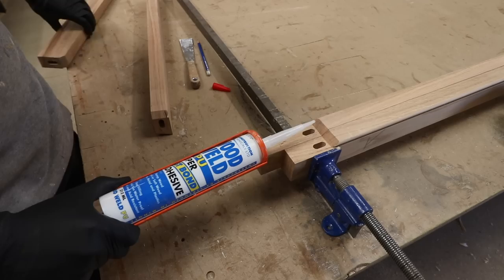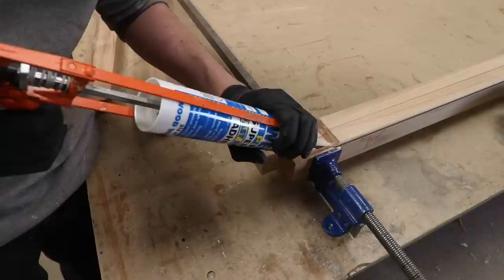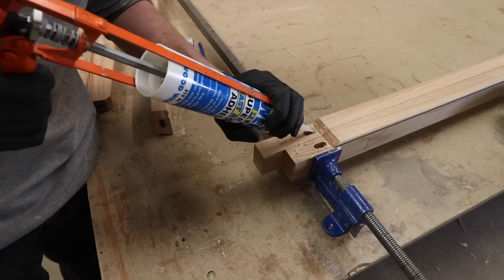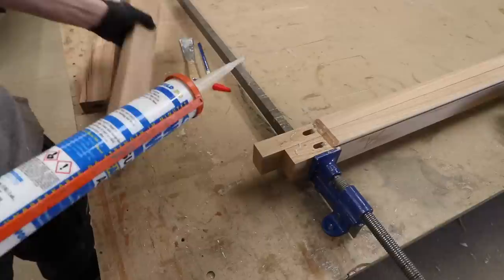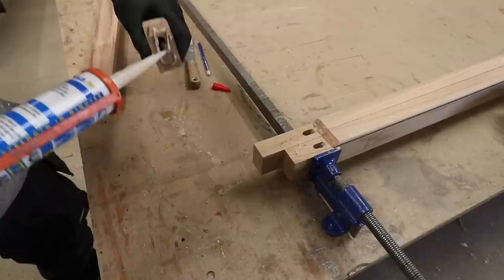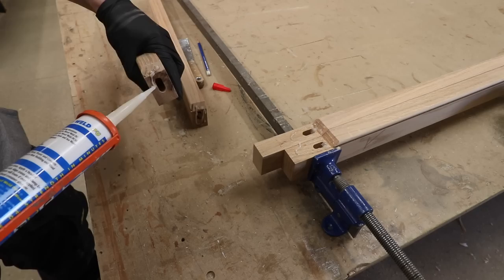I've found the transition from traditional glues like Cascamite and PVA type bond stuff to PU quite difficult, really, for a start. I found it hard to apply, found the glue cleanup a pain. I just never was that confident in it, but as time's gone on, I've learnt some techniques in application. Make sure you're really prepared for a glue-up beforehand, and don't start gluing up and then realise you need to get your wedges out, or you've not got your clamps ready, as PU's not forgiving on time.